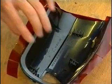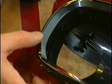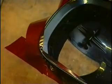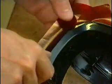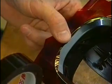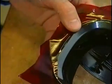A prerequisite for vacuum casting is a perfect master model, which can be made conventionally or by one of the new generative techniques like stereolithography, FDM or LOM. Given that not only the part itself, but also every scratch, every pore, and even a fingerprint will be duplicated by vacuum casting, the surface of this master model must be absolutely perfect and not defective in any way.